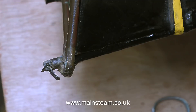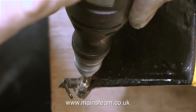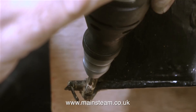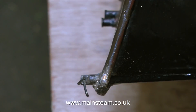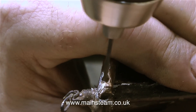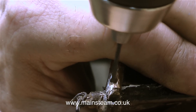A shape like this is quite difficult to clamp and it wouldn't be permanent anyway. The combing around the top edge of the hole — the part painted brown — is made from brass, and the main bow support is also brass. Using my Minicraft drill I'm attempting to drill a hole through the side of the combing, but it's not working; it goes too fast. So I switch to my Makita drill, a standard battery-operated drill that's slower and more powerful.